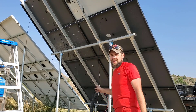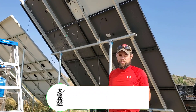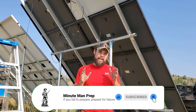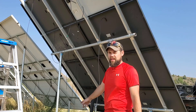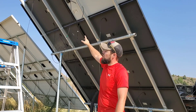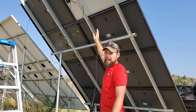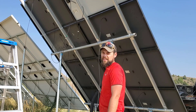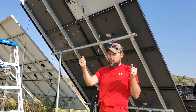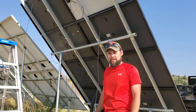The last step is wiring. For the mini split air conditioner, it's 100% solar powered — no grid power. It only works when solar power is going to it. We connect all eight panels in series: I've already connected the top two, so now I go positive, negative, positive, negative — male, female, male, female — all the way down the sides. At the bottom I'll be left with one negative female and one positive male; stick them into the main line and we'll be powering that mini split.